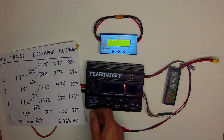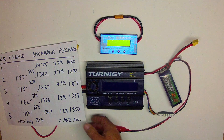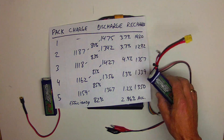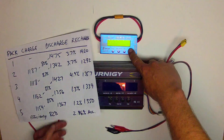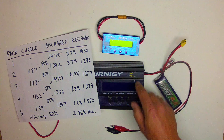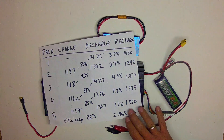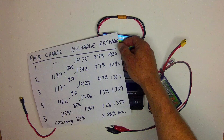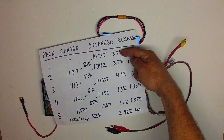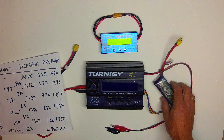Practically, if you're using a car battery or other finite battery source with this charger to charge your LiPos at the field, you may want to factor in about a 20% loss in overall milliamp hour capacity. The other interesting finding comparing the milliamp hour readings from this HobbyKing HK010 watt meter and power analyzer versus the charger was that they were on average about 2.96% different from one another — varying by a few percent each time but averaging about 3% difference. That's a pretty acceptable margin, so I'm happy with both of these products and it was a fun little experiment.